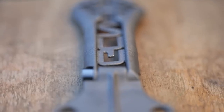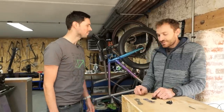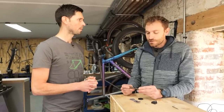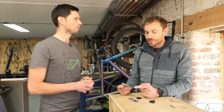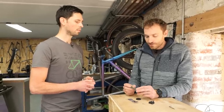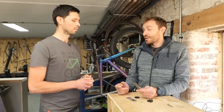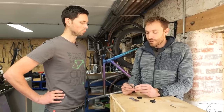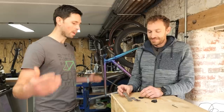Would it be possible to make it shiny or could we also add some color to this? Can we get it to look anything like any of those colors? Yes, we can. As it's come out of the printing process and the support scaffold has been removed, nothing else has happened to it - it is quite a grainy, almost orange peel texture. That can be smoothed by sanding or polishing by hand, or using automated processes. We can also just anodize it as it is - often you'll get a slightly more vibrant color from a rough surface when anodizing titanium, so we should probably just put some color on it as it is.